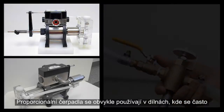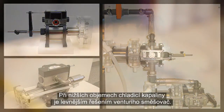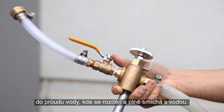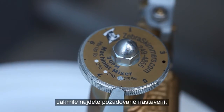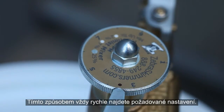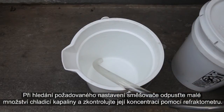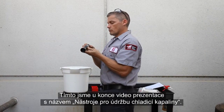Proportional pumps are usually used when higher volumes of coolant need to be made frequently and when coolant needs to be pumped over longer distances. When lower coolant volumes need to be made, the Venturi mixer is the less expensive option. The mixer uses water pressure to draw a metered amount of concentrate up into the water stream, where it mixes completely with the water as it's dispensed. The mixer can be adjusted to output a range of concentrations, and once you've found the setting you want, note the position of the dial or mark it in case someone else adjusts it. Place the mixer's suction tube into the concentrate container, then connect the mixer's water inlet hose to the faucet. Dispense a small amount of coolant and check it with your refractometer. Once you have the mixer adjusted to your satisfaction, you're ready to mix coolant.